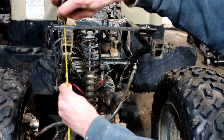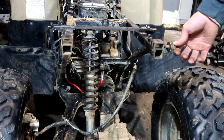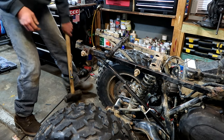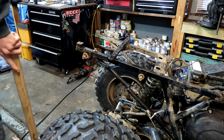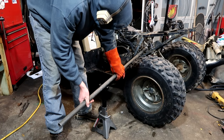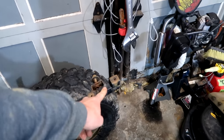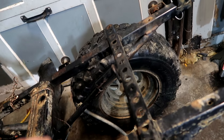I've got thirty and a half exactly on one side, and thirty inches on the other. So we've gone up a quarter of an inch already, and we haven't bent that thing into the correct spot yet. I have made a little bit of progress — this end has come up a little bit. I can't just put a pipe on the end of this and pull up, because what will happen is this will just bend somewhere in here since there's no support on it.